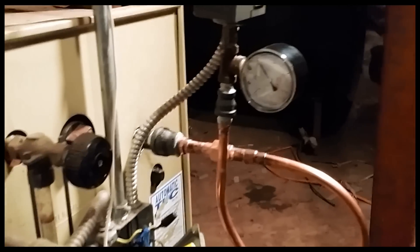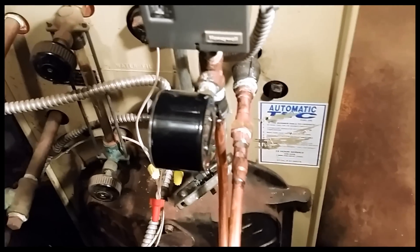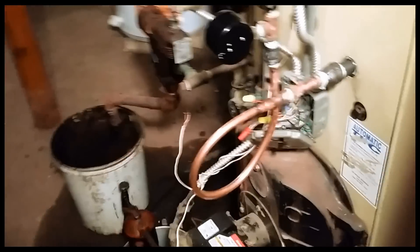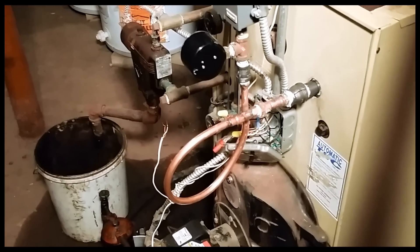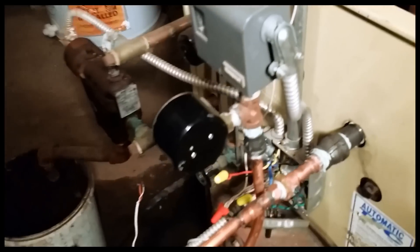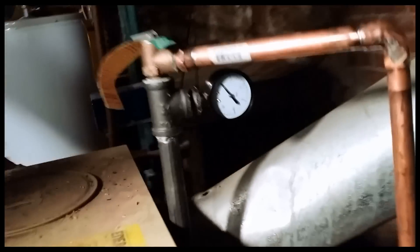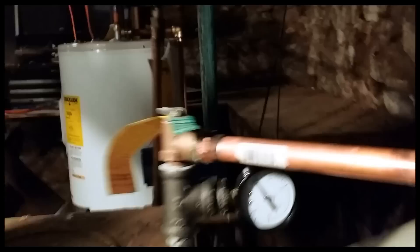This is a nice looking gauge — a zero to five pound gauge. Since we're only running a pound, pound and a half, maybe two pounds of steam, it's really handy to have that kind of gauge on the system. I really wish I could have actually turned it upright, but it's really tight in there. One day I can put an extra nipple in there and twist it so it actually faces upright. Back here we're still on zero — so far these are in agreement.